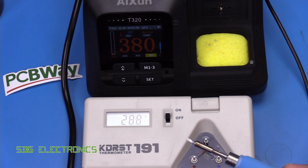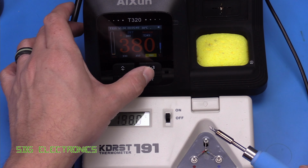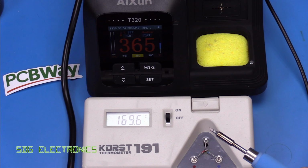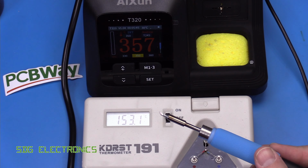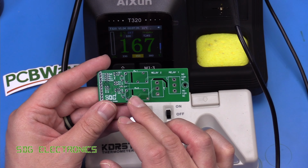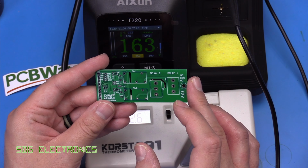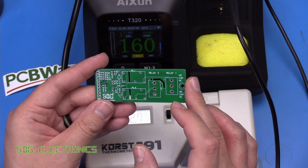Now if I change the tip, obviously that's going to be different. But that's well within what I would consider acceptable limits, certainly within the IPC standard there for those temperatures. So I'm pretty happy to go ahead soldering with that. So let's test it out with a little bit of soldering here. We've got a mix of through-hole and surface mount soldering on this PCB that I've had made at our sponsor, PCBWay.